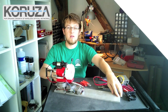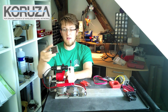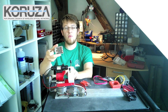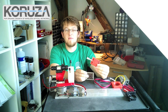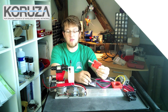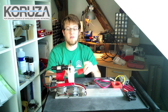I'm continuing on the same path of development with other parts. I have replaced the linear translation mount used to focus the beam through the lens with a 3D printable one that has exactly the same function but is much cheaper and simpler to produce, and I can integrate it into the whole design so it is just a part of the bottom bracket.